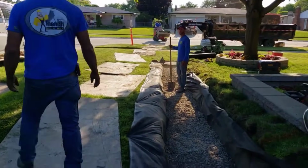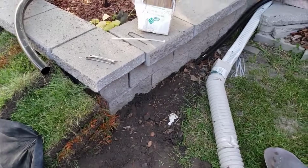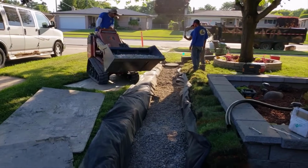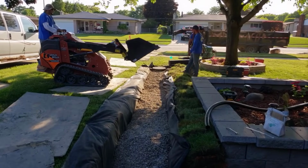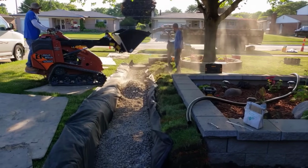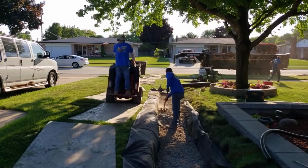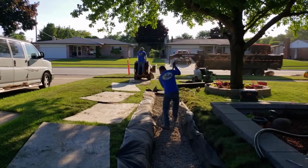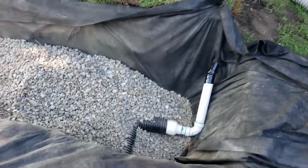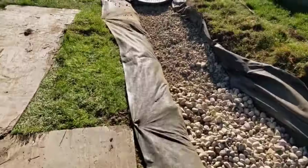It does tighter bends. A lot of people want me to build sump systems and lift stations that have it discharging from a certain point. And I tell the girls in the office, I don't understand. I mean, I'm building them in the best interest of the client. It's the way the pump sits in there. It's so that the float isn't near the sidewall of the chamber. There's nothing to touch the float, so it can't hang up. You can just buy the black discharge line and it'll make a sweeping 90, or it'll make a sweeping 180. I mean, you can take it wherever you want.